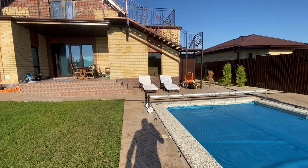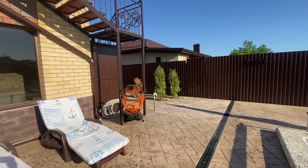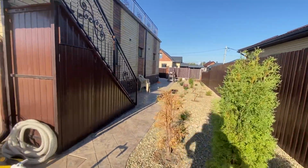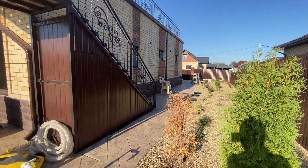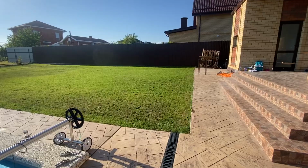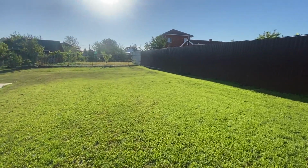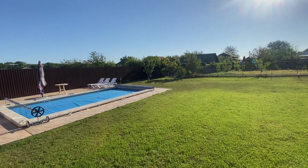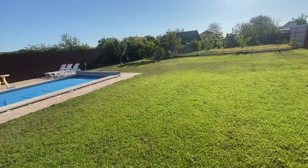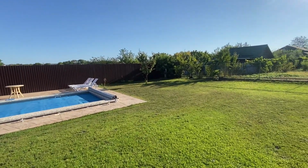Next, I think, once the tiling has been completed, will be the ceilings. We've got to have, obviously, one in the sauna, which will be insulated and very sturdy, because we're probably going to build above that at some point. Use it as a storage area. And the one in the shower room is going to be the vinyl type ceiling that we had throughout the house. They basically put a track around the outside of the ceiling, and then you get this, looks like a bag effectively, and it gets clipped into the track all the way round, and then they get a giant space heater, and it's like a shrink wrap. It shrinks and it goes up and gives you a really smooth taut finish.